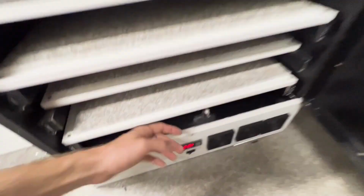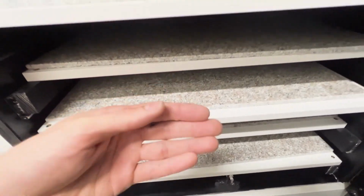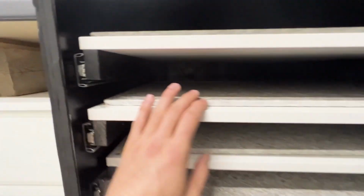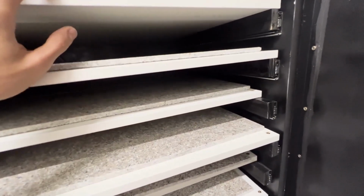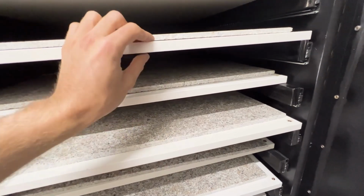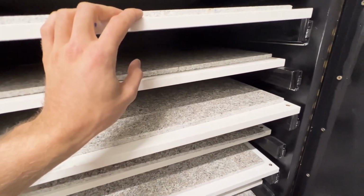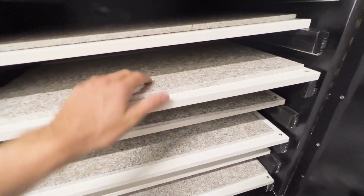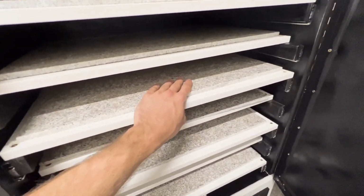The air actually goes from underneath, it comes here, then it goes underneath on the other side, it comes back here, underneath, like this, you know, it's like a snake coming through. And then, like I said, it's being pulled out in the back, so more or less all of the plates are getting a constant fresh air supply, so drying is really fast. With my latest tests, plates can be dried in a matter of hours, which is really awesome. And this makes the production of Zebra dry plates and Zebra dry plate tin types just that much faster.